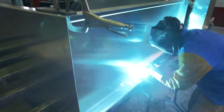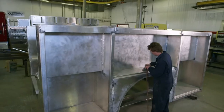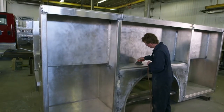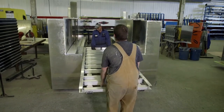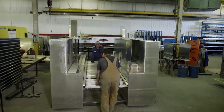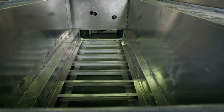Then the side cabinets are cut, shaped, and welded. The aluminum surface is buffed with a sander to prime it for painting. The subframe is then added to the side cabinets, forming the enclosure that'll hold the water tank. It's got a 14,000-kilo maximum capacity, so it can easily support the tank, which weighs about 4,000 kilos when full.